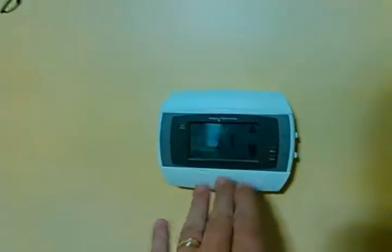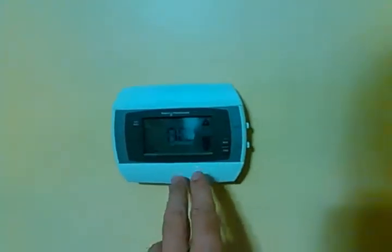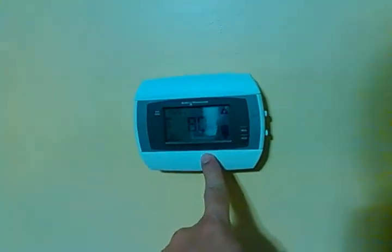First things first. I spent forever trying to get this thing linked up to my Wink Hub, only to realize that all I had on the side in my R1 radio slot was a Wi-Fi card. I thought the cards were dual — like a Z-Wave card and a Wi-Fi card — and that's not the case. If you want your radio thermostat to work with a Wink Hub, you are going to have to purchase a Z-Wave card. The model number is RTZW-01, and they cost about $20.